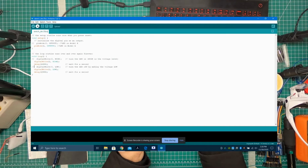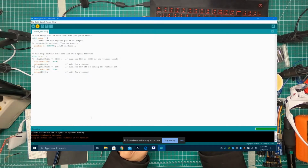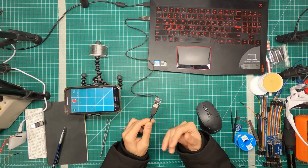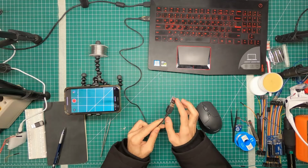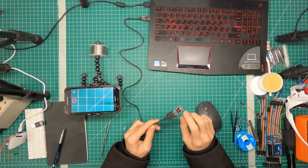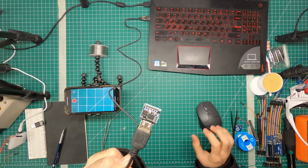And the way to upload this is that you don't plug the device in, you first hit upload, and it will say plug in the device now. So you have a few seconds to do that, 60 seconds. Plug it in, and then it gets automatically detected and unplugged. So it gets virtually unplugged. So right now your USB is giving power to this board, but it's not communicating with the board. So you can see that you have one of the LEDs blinking, the red LED, and that's pin 1.